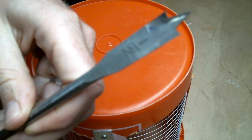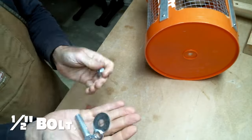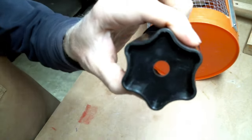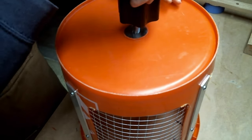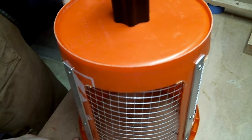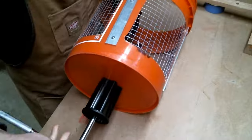With a small pilot hole and a half-inch spade bit, I made a hole in the bottom of the bucket for a half-inch bolt. Together with a fender washer, a lock washer, and a nut — those were the only other things that cost money for this project. I ran the bolt through the black plastic part salvaged from the kid's jeep and attached it to the bottom of the bucket. I have no idea what that black plastic part is called, but if you know, feel free to let me know in the comments.